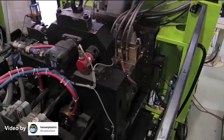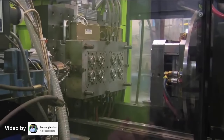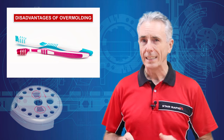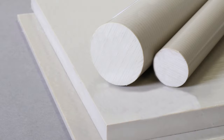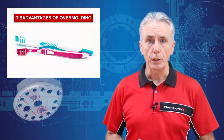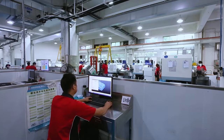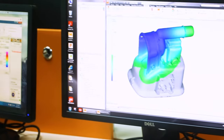What are the drawbacks of two-shot molding? The design of overmolding mold tools is more complex, so it takes more time and costs more money. Dedicated equipment is necessary, although it is possible to add an auxiliary piggyback injection molding barrel to convert a conventional machine to a two-shot machine. Most importantly, you must ensure your choice of elastomer is compatible with the thermoplastic substrate — nylon, PEEK, ABS and some other engineering grades can be difficult to bond with. To deal with this, plasma surface preparation and other treatments can help improve bonding. Remember, to get the best results you need to work closely with your manufacturing partner in the early planning stages to optimize tool designs, materials, and process parameters.